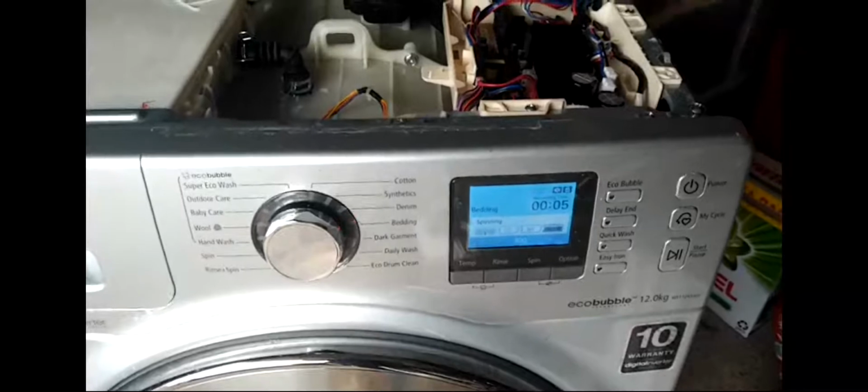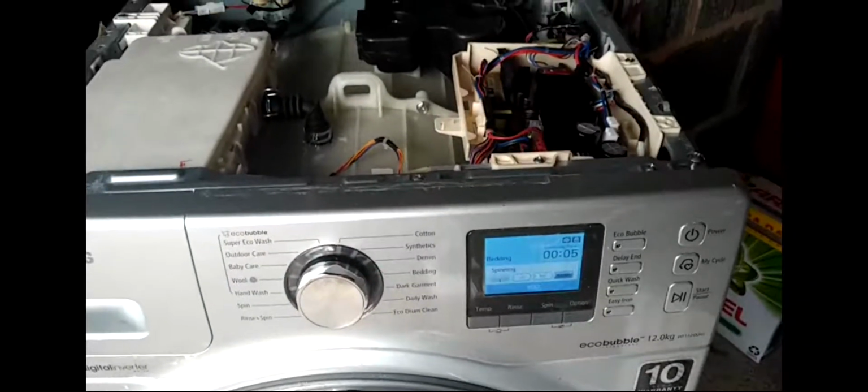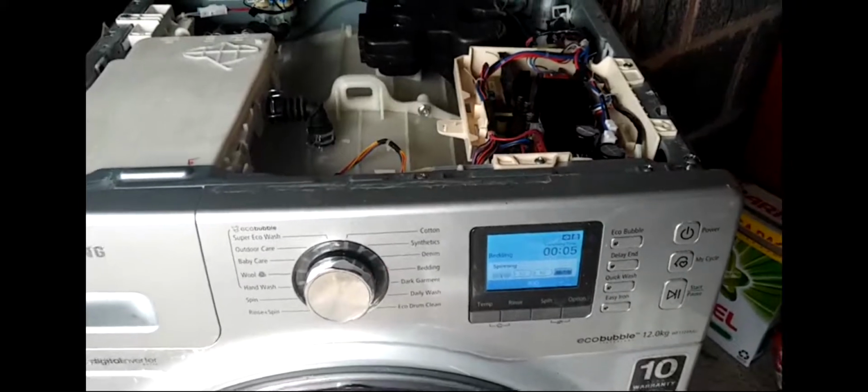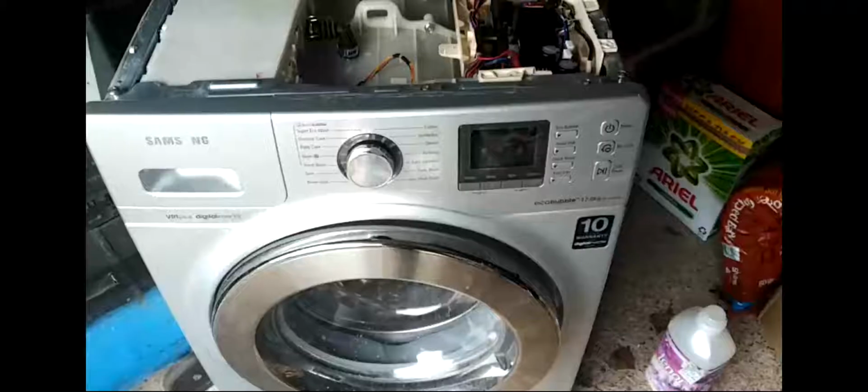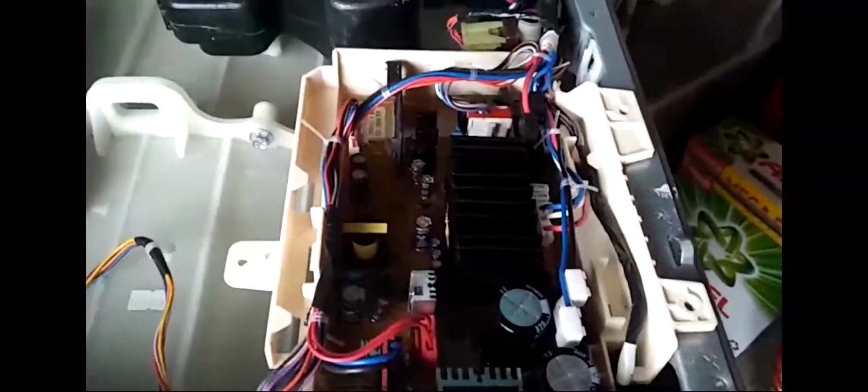I'm not going to record it, but I'm going to take you to the next video where I remove it and show you the back side of it and what needs doing. Okay, the washing is done. So remember, make sure you switch off from the mains, and I left it for about 20 minutes because that could be the capacitor, so I don't want to get an electric shock from the capacitor.